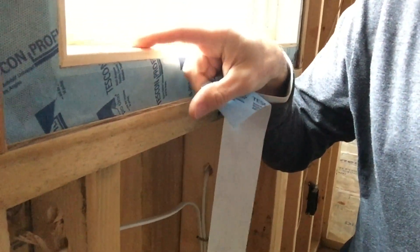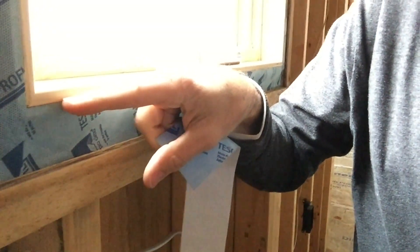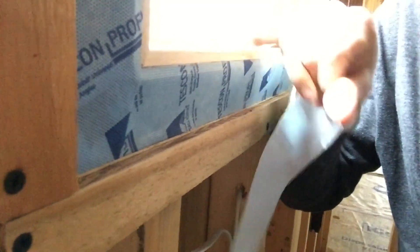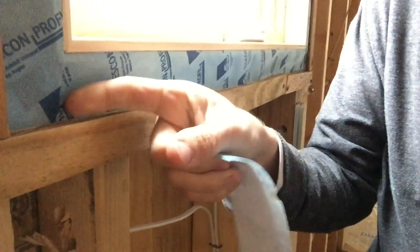Here's what that tape looks like. It's about two and a quarter inches wide, and it's got three pieces of paper on the back that you can peel one at a time. You start by peeling off the narrowest strip first, and you run it about three-eighths of an inch from the inside of the frame. Our trim will be one quarter inch from there — standard three and a quarter to three and a half inch wide trim on sides and bottom. Then you span the gap between the frame and the rough opening. Once that's secured, you've got overlaps so it secures really well to itself.